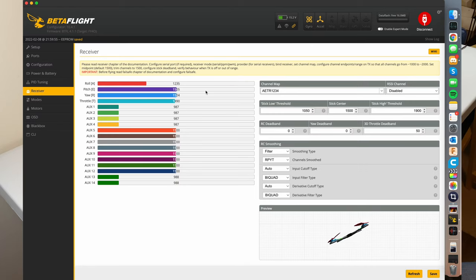If I'm moving my throttle right now, my roll is moving. If I'm moving my pitch from side to side, I can see that's working. My throttle is not working though, and my yaw is working. So we need to move around our roll and our throttle because those are on the wrong sticks. I'm going to type in TAER1234 and hit save. All of my channels are now where they're supposed to be, but you can see they're not centering on 1500. This is where you can trim your drone right out of the box.